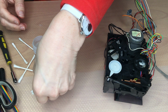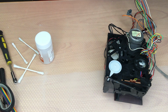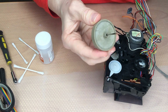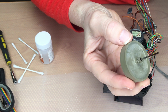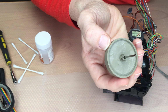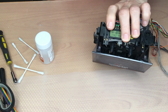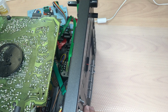If you watch carefully the mechanism, you can see the capstan flywheels are missing. Well, this is the tape mechanism from unit number 4, and look what happened to the capstan wheels. Oh, the gear is broken, lost almost all the teeth. That's going to be a challenge to repair. We will see how we can get on with that. But I'm going to do this also with the unit number 3. And here we are.